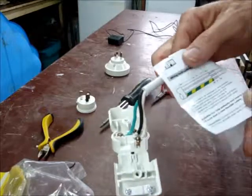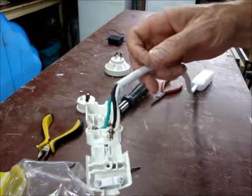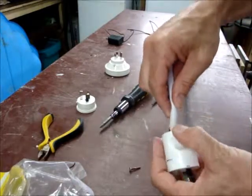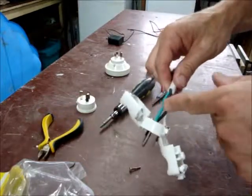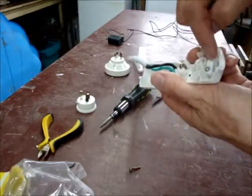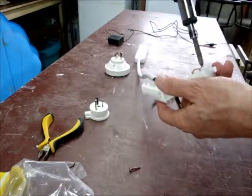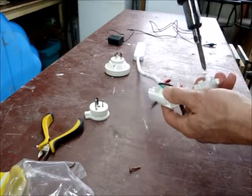One thing I didn't check: the cable should be stripped back to a length of 34mm. I had this already long — I can see it's over 40mm. So the question is will I be able to fit it all in. If I can't, I'm going to have to trim these and redo it. Because I'm using a thicker cable, this cable clamp piece is going to be in the way, so most likely I'll have to remove it.